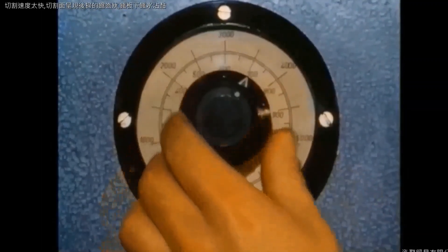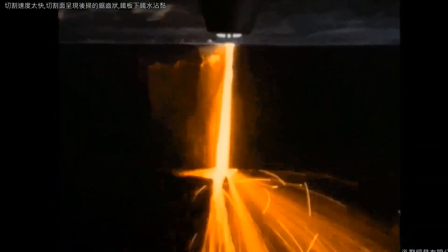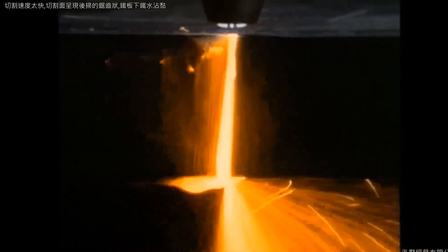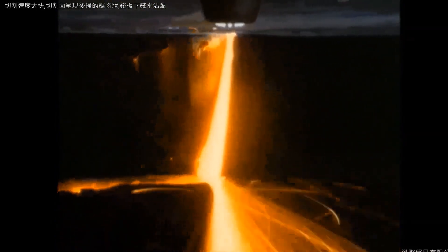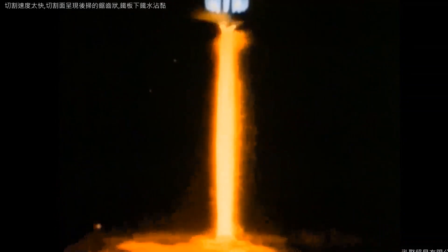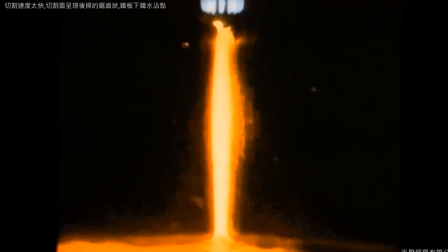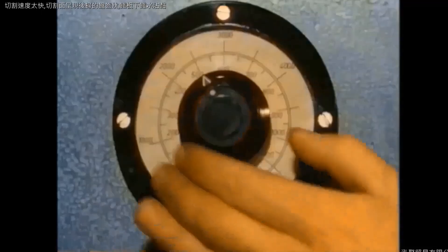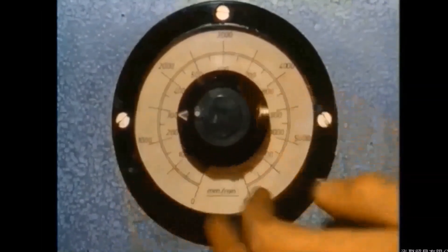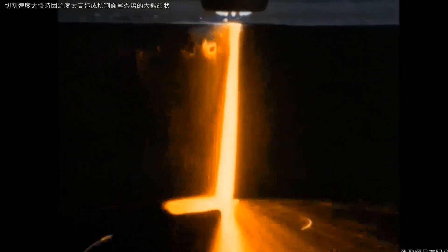An increase in cutting speed from the normal 530 millimetres to 700 millimetres per minute causes greater drag and increasing adhering slag. The cut in the plate demonstrates that too high a cutting speed causes hollow kerfs, and on the underside the cut edges are rounded. If we work with a cutting speed that is much too low — instead of the specified 530 millimetres, only 300 millimetres per minute — very substantial cutting defects may occur in the shape of craters, quite apart from the fact that economical operations are entirely out of the question.